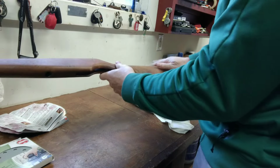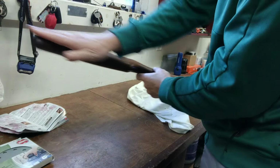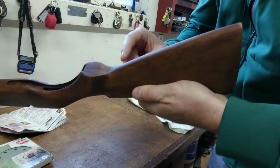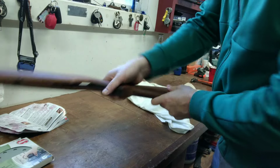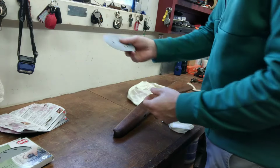It looks pretty cool. I'm sure if I just coat it right now, it'd look pretty classic, but I think I want to get it a little cleaner and then build back up and start as far as numbers. Just like down here, this looks very blotchy, and I want to clean that up a little bit before I true oil this thing. Using 100 grit right now.